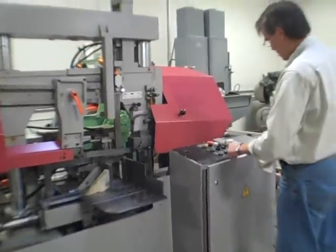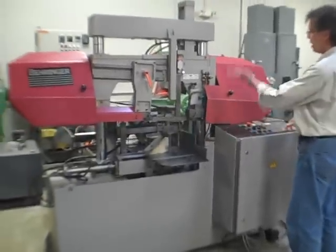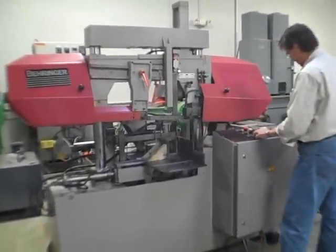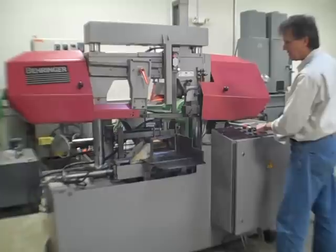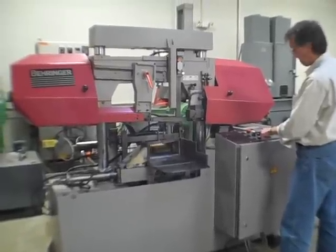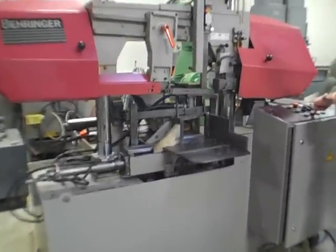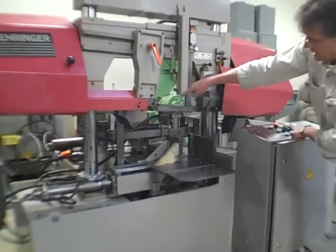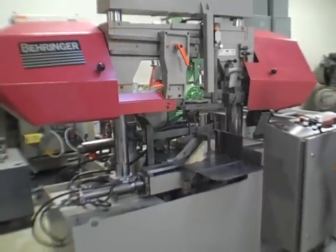We can do that right now. If I shut the blade off and bring the hydraulics back up, you can take this all the way up. Here's the front vise and the rear vise — here's the front one, all the way up. This one closes automatically on auto start. And the rear one is the feed vise, which goes all the way to the rear. Once we start auto cycling, you can see it back there — the feed.